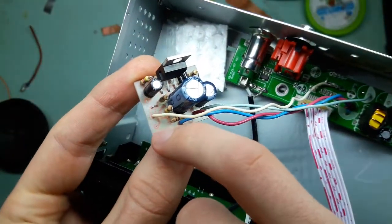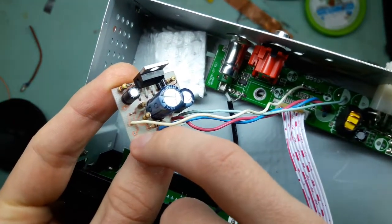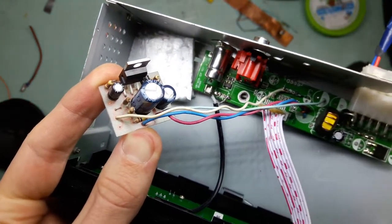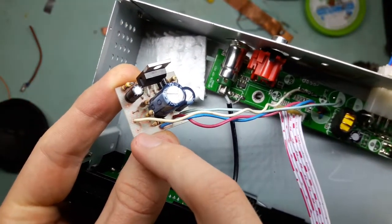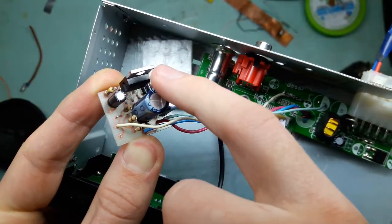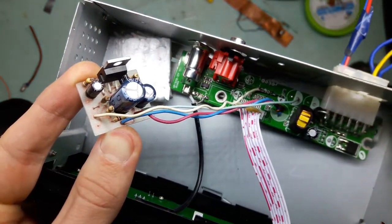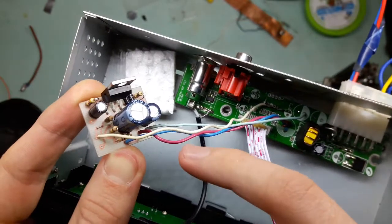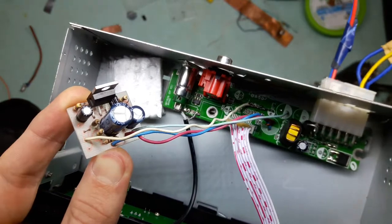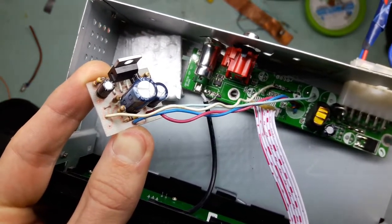This thing is a little, it's a hack really, it's a shutdown. TDA2030 does not have a shutdown. The way I implemented the shutdown here is I just go and ground the non-inverting input of the amplifier. I connect that node to ground, and by doing that I short out the signal, so there will be no signal to the input of the amplifier.